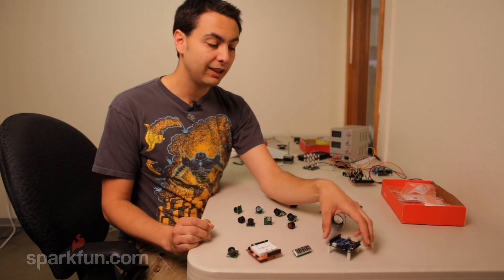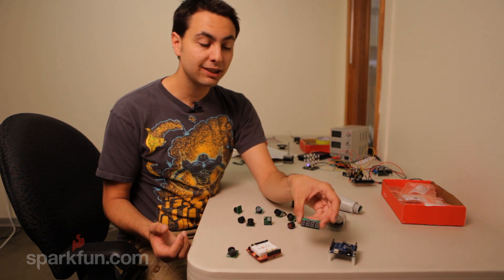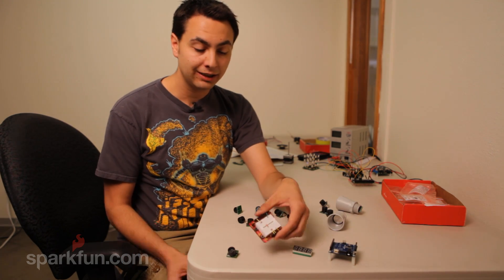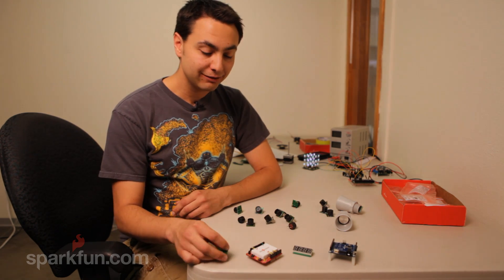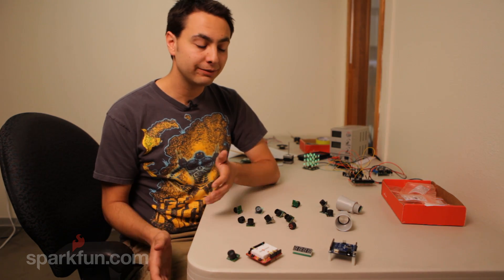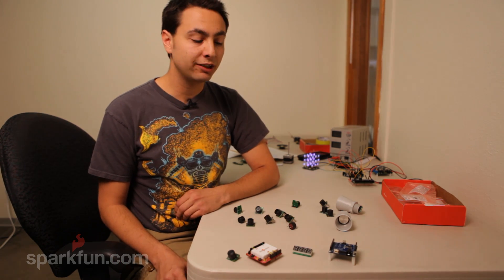To demo this sensor, I rigged up a little Arduino project using an Arduino Pro, a serial seven segment display to show the actual reading of the sensor, and then it's all going to go onto a proto shield. For this demo I'm going to use the LV series, which is the most basic that we have. We have a bunch of others — they all have different beam properties, different distances, different widths. They're all pin-for-pin compatible, so you can drop whichever one you want into your project depending on your application.